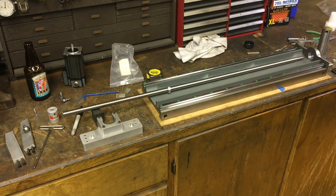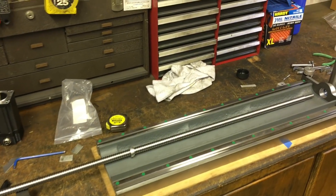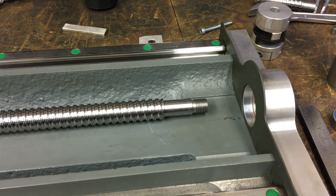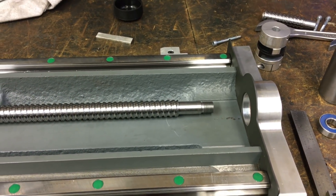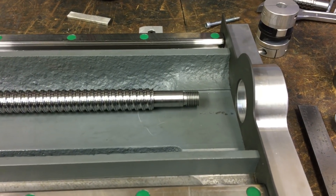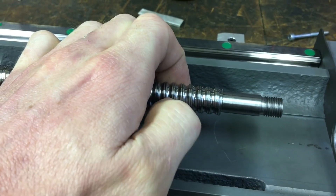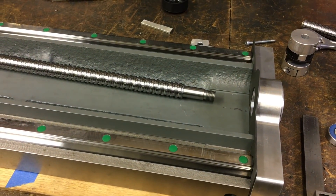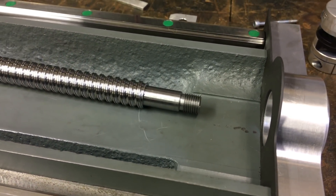The screw was straightened and I got the first end machined yesterday, so we'll take a look at that. Was able to hard turn it — didn't anneal the ends — have a pretty rigid lathe. Got it done with just conventional carbide insert tooling, no CBN or anything. From the rolling process this stuff is extremely hard, but once you get under that sort of case or crust or skin, it's definitely doable. Did a nice 7/16-20 thread on the end.